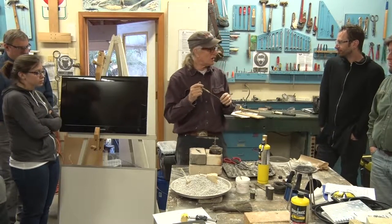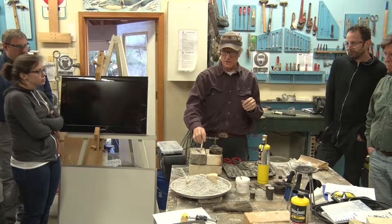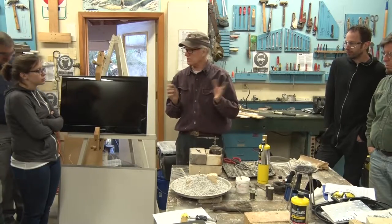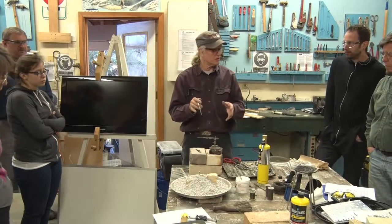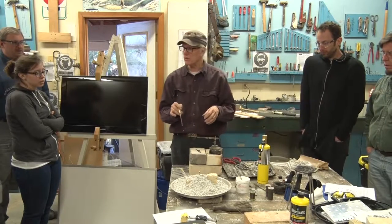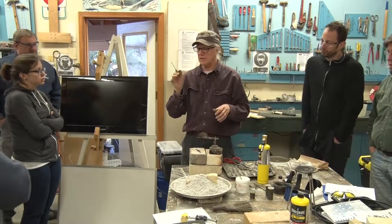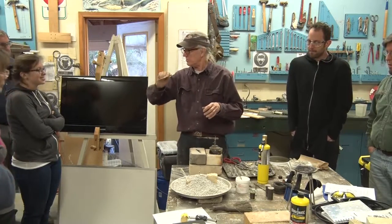And I have a small piece of sheet here and a big chunk of rod there. And which one's going to heat up first? If I heat them equally, you know, at the same time, the same flame. Yeah, so the smaller piece will heat up quicker, and that solder will jump over to the small piece, and then you need your little pick to shove it back where you want it to go.